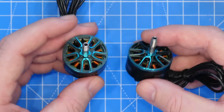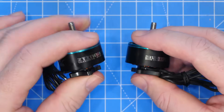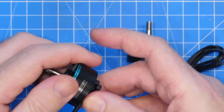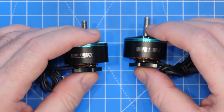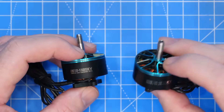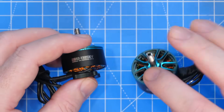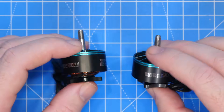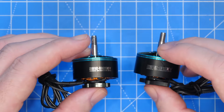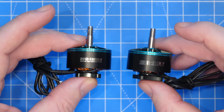Overall some really nice big motors depending on what size you want to build. Between these two setups you've got the 915kV and the 1325kV. Obviously the 915 is going to be a slower motor compared to the 1325 - you're going to potentially throw a bigger prop on it, or you might want to fly with the same prop but have a little bit more efficiency on the 915 compared to the 1325. It's really going to depend on your choice of setup.